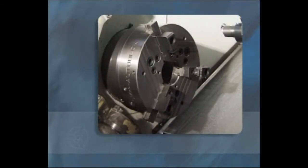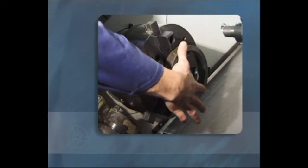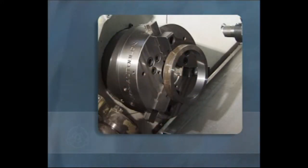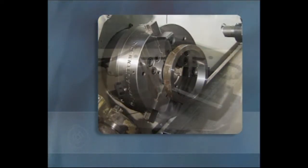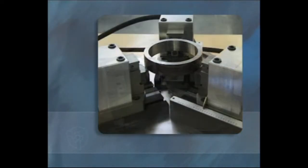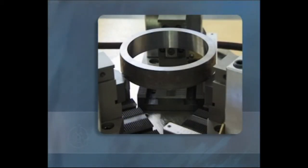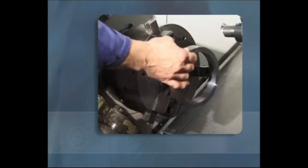Processing a bearing ring with external diameter of 155 millimeters and finished inner diameter of 138 millimeters. The workpiece is indented with the existing Ino-Grip jaws. If the indentation is not to be made in the clamping jaw, it can be carried out at a separate stamping machine. In the case of large volume production parts, stamping and clamping can even be carried out in one process by means of a twin pressure cylinder, or a stamping system can be integrated into the loading station.